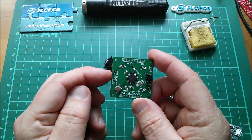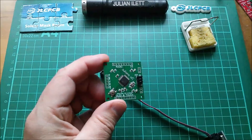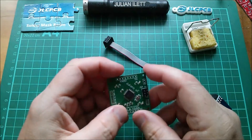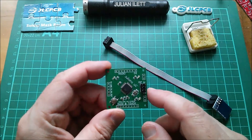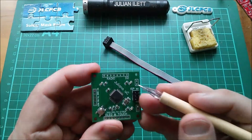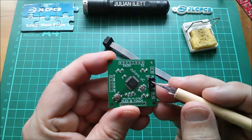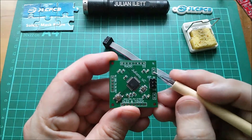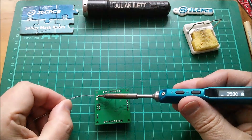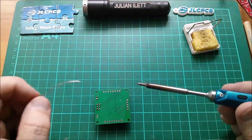To see whether we can program it, I need five pins to connect it to a USB-to-serial adapter. One of these headers is the D13 link. I'll just put this back into the camera — the battery in my phone is awful, I bought a cheap one on eBay and it only has about two hours' juice. The link that does the D13 LED — I have to identify which of these two it is. I can see a track running from there round to the ISP header. The ISP header has SCK on it and I believe SCK is also D13. So that's got to be the D13 LED. Let's get a two-pin header and a five-pin header in there. That gives me my D13 LED so I can do blinky.